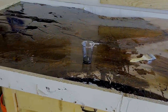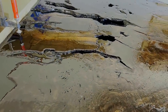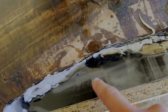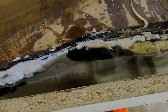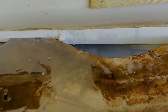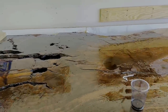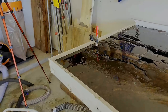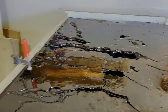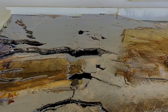Well, this sucks. The caulking failed right here, so there's a pool of epoxy. I drilled a few holes so I can empty into a bucket to at least save some of the epoxy. I tried damming everything off a bunch - it just really wasn't working out. The idea I had that seems to be working is to shim everything up on this side, force it all to flow over to the front end. Once that's at least a little bit set up, I'll pour the rest of these voids, and then hopefully pour that one little area over there.